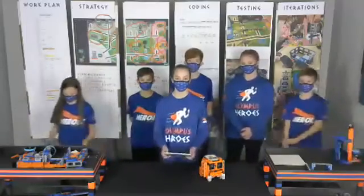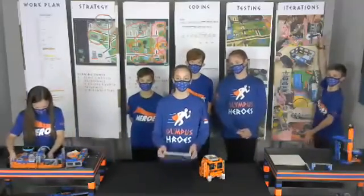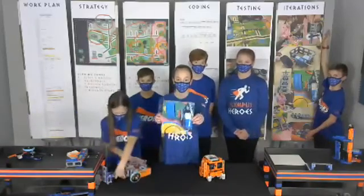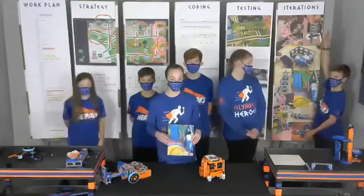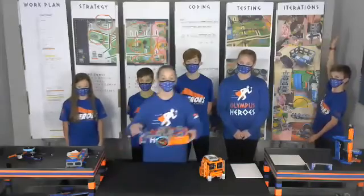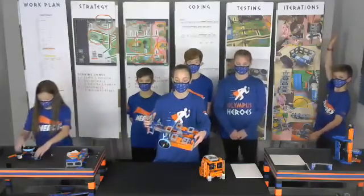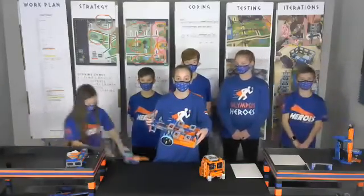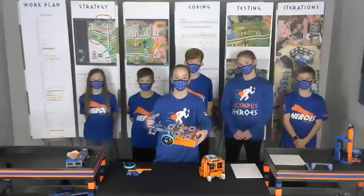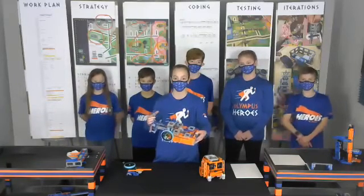My mission went through the most iterations in building and programming. I started with a solution for the treadmill that used a motor outside of the robot. But once the chassis was built with 4 motors, I realized I needed to come up with another way. So I created this sled. The robot pushes it down until it hits the east wall, then it continues pushing it, which makes this part slide in. As it travels inside the shell, it makes this wheel spin, which moves the treadmill.